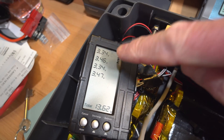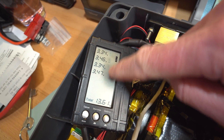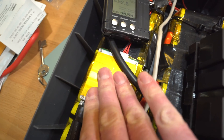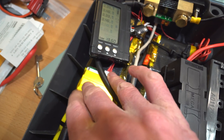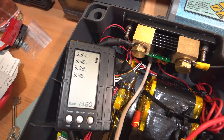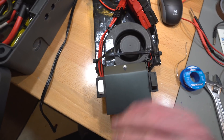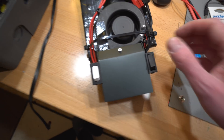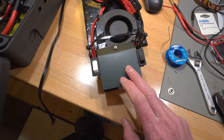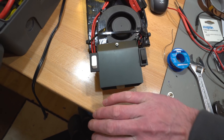What we're really interested in is these cells — making sure that when they hit about 3 volts per cell, the BMS cuts the power. There's no warmth there whatsoever. At 15 amps this BMS is perfectly fine — it's rated at 100 amps, though you can never really believe those ratings. It looks like it's going to be going for quite a while; there's not really any voltage shift going on at all. This fan is actually slower than the other one — less air coming out — yet the current is higher, which is a bit odd.